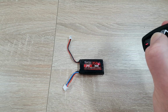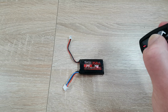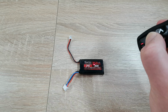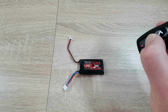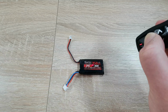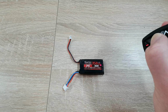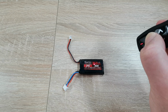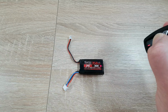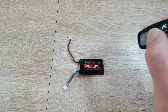Just for a quick check, you can multiply the capacity by the C rate and get the discharging amperage for this battery. In this case, this is 10.5 ampere. But keep in mind, every chain is as strong as its weakest link. And I don't think the power lead or the balance lead or the plug might withstand such an amount of amperage. Please be careful with the C rate. First, it's meant for discharging, and second, too many manufacturers use the rate for show-off against their competitors.